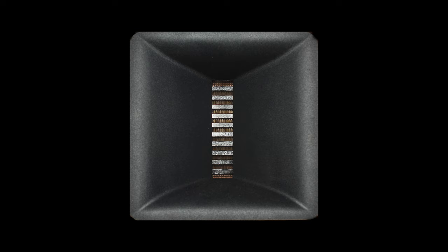When you cross over at 1 kHz or less, your ear is sensitive in that range, but when you get up into the 2 kHz and up range, your ear is really sensitive to switching over from a mid-range to a tweeter. If you cross over at 1,000 Hz or less, then you have the entire upper half of the spectrum coming out of one single diaphragm — that gives you a lot of that coherence, like when you wish you still had your Quad 57s. It's more one piece, it's a true point source. Without the BEMA AMT driver available, it would be difficult to pull off the X3. When you put them all together and integrate them correctly, you get what I like to call a very large studio monitor with no box — super fast, super dynamic, super clean, but no box effects.